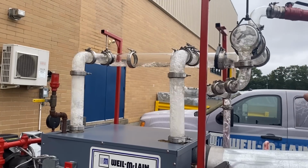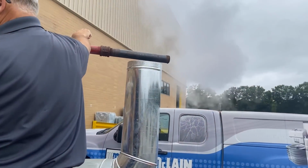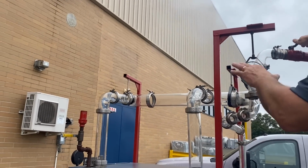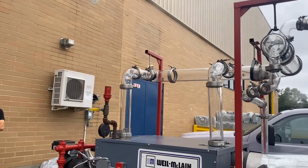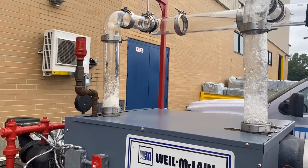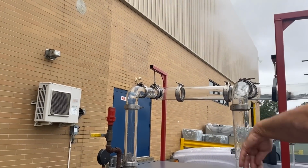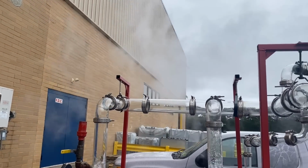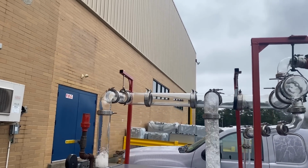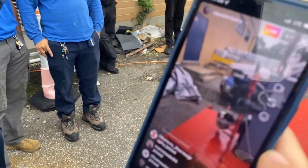Now, I can try to simulate a building by closing the ball valve down a little bit. That's going to calm it right down. A little bit of back pressure to reach the boiling point. And you reduce the boiler down, water jumping out. Try to regulate it so that's like your perfect normal boiler, right? You get a little bit of bounce out of it, but whatever's coming out, the gravity is pulling it right back into the boiler. It's a little dry up here. That's how you want the boiler steam system to be operated.